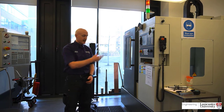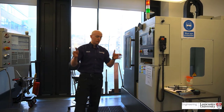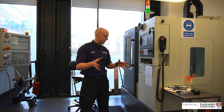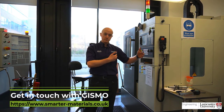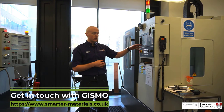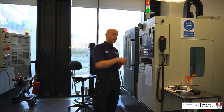Hi, my name's Nick Renningsen, I'm one of the Mechanical Engineering Technicians in the Engineering Department at Lancaster University. This is our CNC machining section. This machine is our XYZ 500LR — it has a workspace inside the machine of 500mm by 300mm, so we can put large components in the machine to machine them, even though the machine has a reasonably small surface area. The controller is an 840D Siemens controller. It also has a DXF recognition file on the controller, which enables us to go from DXF files to a CNC program straight away once we input that into the USB port on the machine.